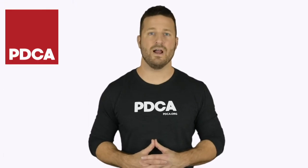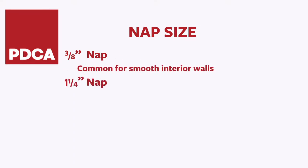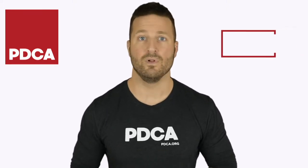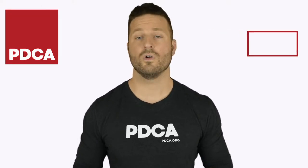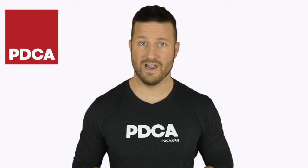Nap size, or pile height, is how thick the nap is. A 3/8 inch nap is common for smooth interior walls, and a thicker 1 1/4 inch nap is better for rougher exterior surfaces. Larger naps hold more paint and so are more productive, good for large walls. But larger naps also leave more stipple. That's the textured pattern the roller leaves on the wall. Short version, if you've got a smooth surface, use a shorter nap. Rough surface, use a larger nap.